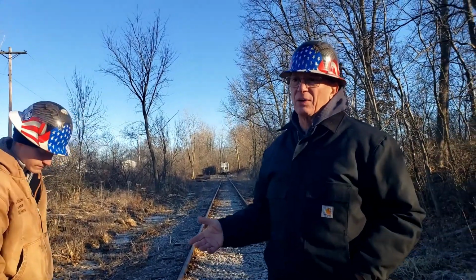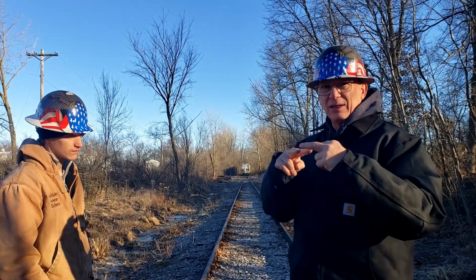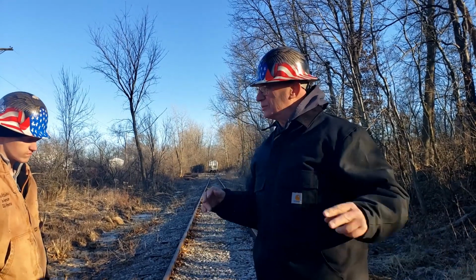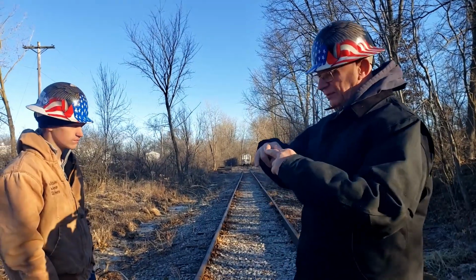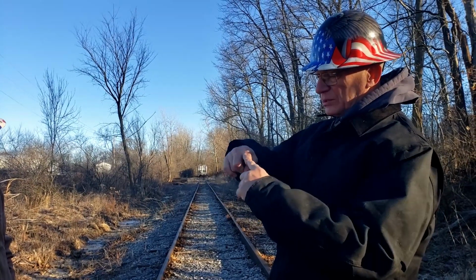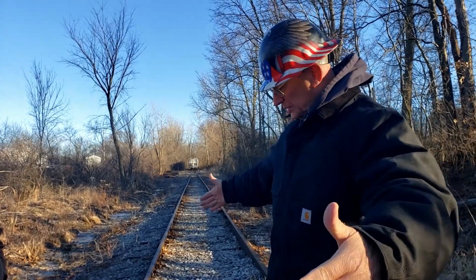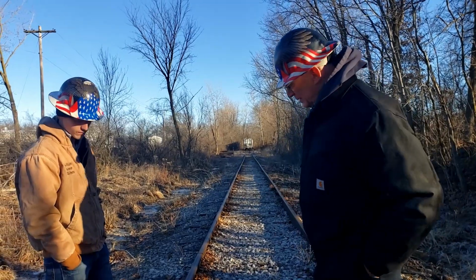It was just interesting. I called a railroad buddy of mine, and he said track assemblies expand and contract together as they get hot and cold. This whole thing pushes, and that's one of the reasons why track structures get loose, because they're all the time pushing and growing and bending, and that's why bolts get loose. Well, if you take a rail out of one side, then this one is moving together, but these are now doing this. Well, the day we came here, this rail wouldn't fit back in. It was too long. So that's some interesting aspect of railroading.